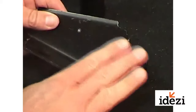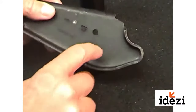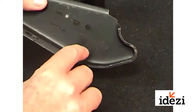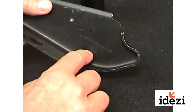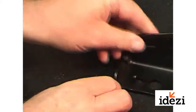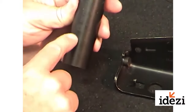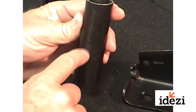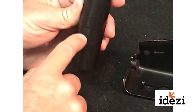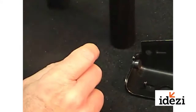In this particular demo I have a number of samples: one that's on a casting, one that's pin marked — and if I move that around you'll be able to see the pin mark on that. This has been pin marked and then e-coated or painted over, and also the ability to read on curved surfaces. This code is really scratched up, but we can read a part that was direct part marked with a pin marker, e-coated over, on a curved surface.